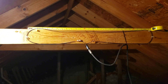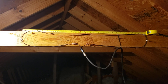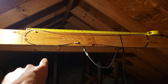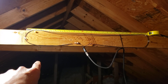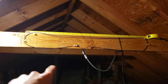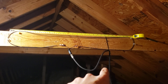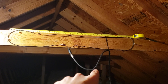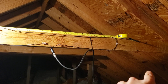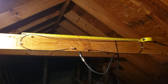In terms of where my signals are coming from: my solo low VHF signal is coming out of the north, about 30 miles away. The channel 11 that I centered this antenna for, because it is the lowest powered VHF channel I have, comes out of the northeast. And then I have all my UHF channels, which are most of your standard networks, coming out a little more towards the east. And this antenna reliably picks up all of them.